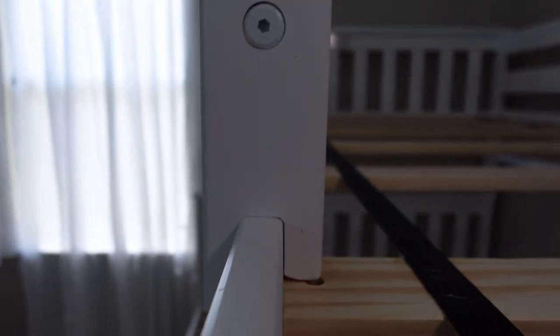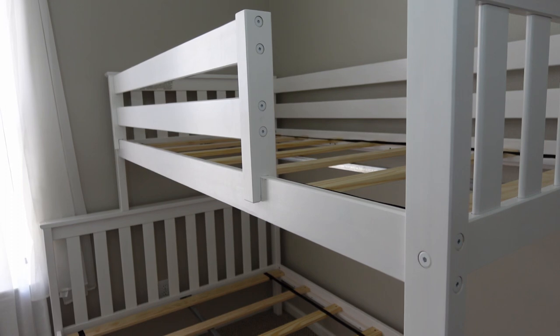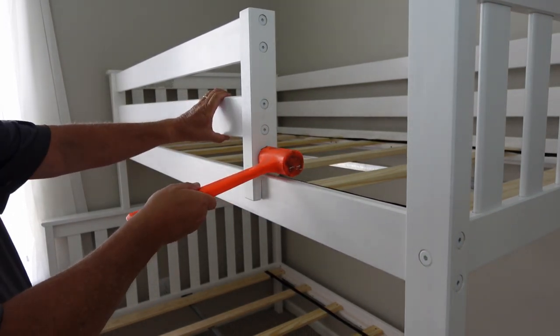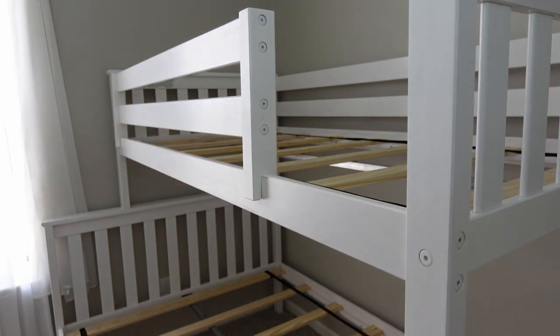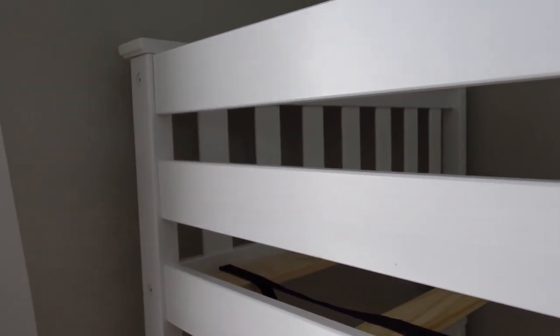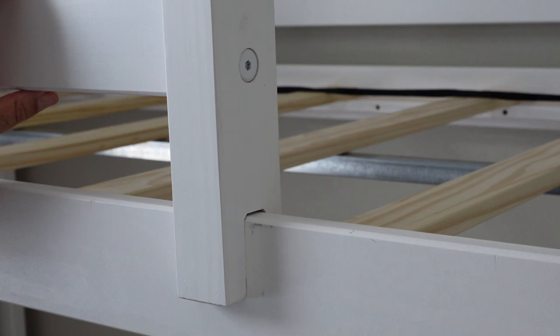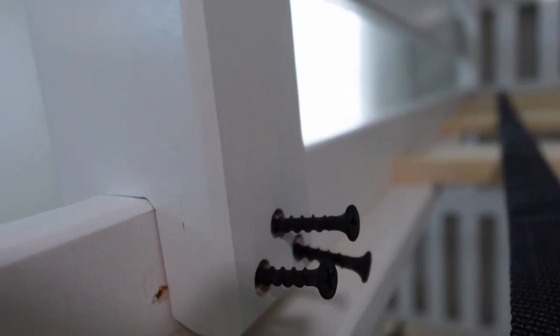The long side of the cutaway is to the outside of the bed and the short side goes toward the inside. Attach the rails to the correct side of the post based on your intended ladder position. Set the safety rails and post onto the side rail and line up the dowel pins on the other end to the holes in the headboard. Softly drive the safety rails into the headboard leg using the rubber mallet — drive them in until they sit flush against the leg. Tap the safety post down to make sure it is flush onto the side rail. Now attach the post to the rail using three screws from the inside.